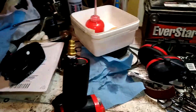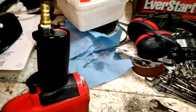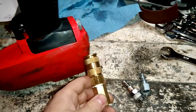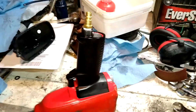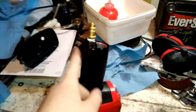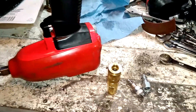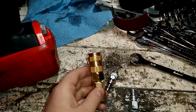For my high-demand air tools I have the V style, and for something like a blow gun or air inflator I still have the M — there's just no point in upgrading those. The coupler was about $14 Canadian and two of the fittings were about $10, so it is a bit of an investment. But if you have a small compressor and need all the power you can get, it's definitely worthwhile. Milton also has different fittings for half-inch, but for quarter-inch or three-eighths air hoses with quarter-inch threads, this is definitely worth it.